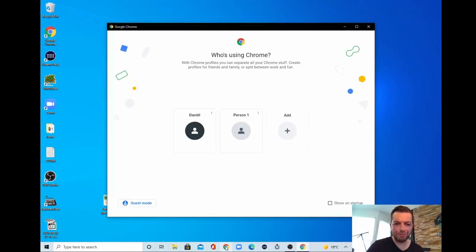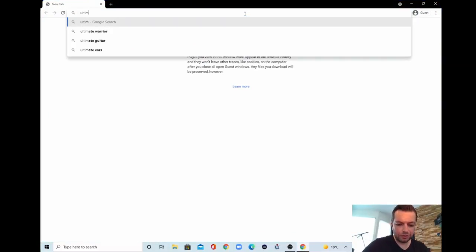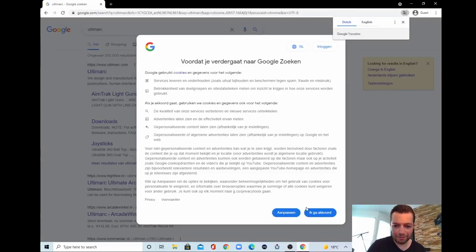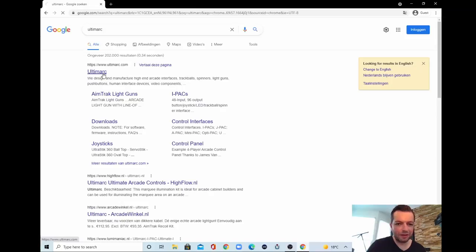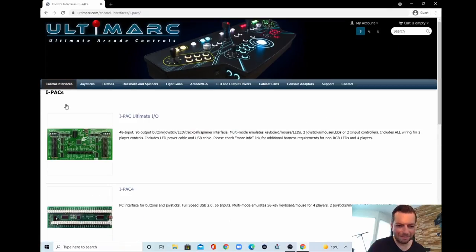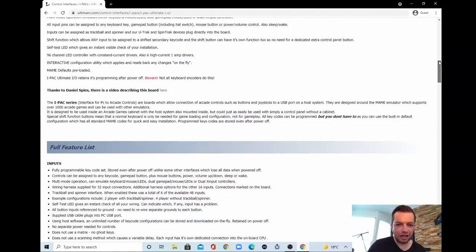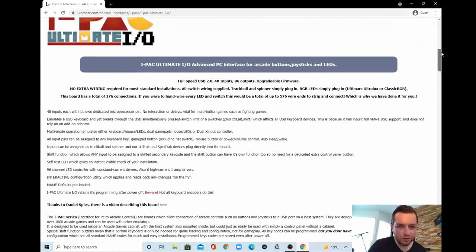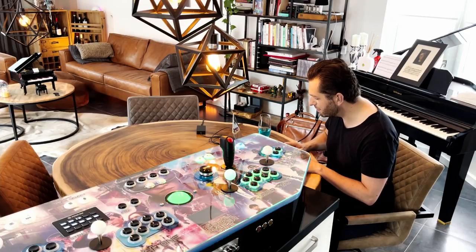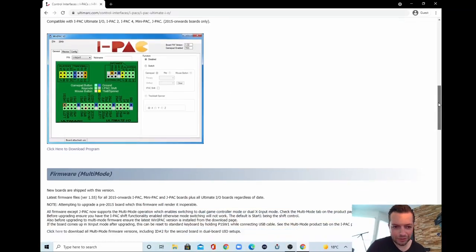And I will take you to the Ultimarc website first, because we are going to download the firmware that we need to give board number 2 an ID number 2. Let's go to IPAC. Let's go to Ultimate IO board. There's a lot of information on this page, but we need to go to, let me see, downloads. And first of all, you need to download WinIPAC, if you did not install that already. We will be needing that later to map all the keyboard buttons.